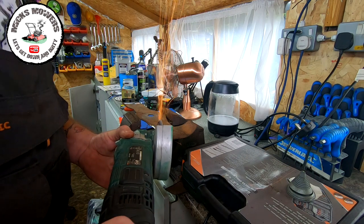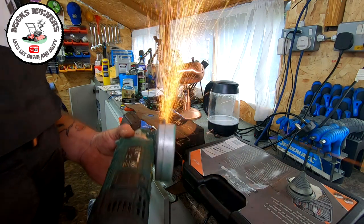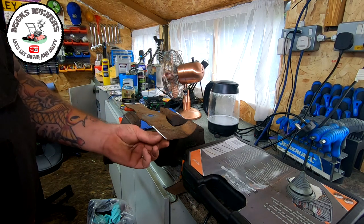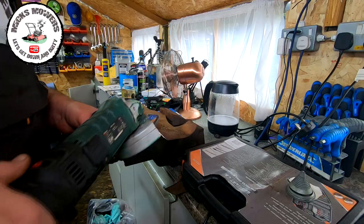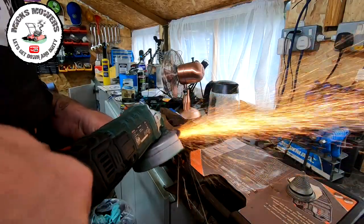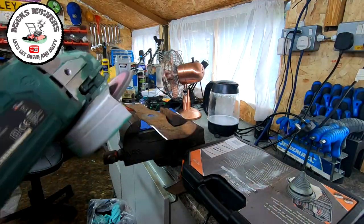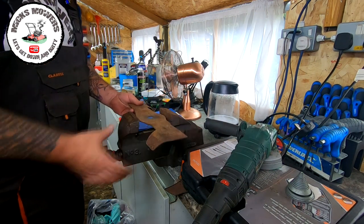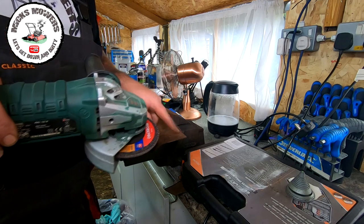Keep checking as you go. That's pretty good — I now don't have that nick, although it's slightly visible on the top of the edge. This blade is now completely blunt and no good for anything, so now I need to re-bring in that edge again just like before. With that done, I want to transfer the blade over onto its back side and tighten the blade back up again, then tidy up the back edge where it's got a bit of burring over.